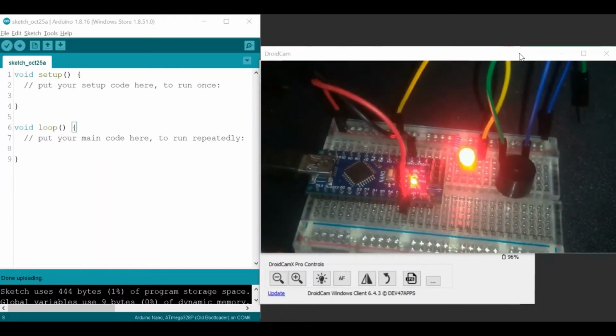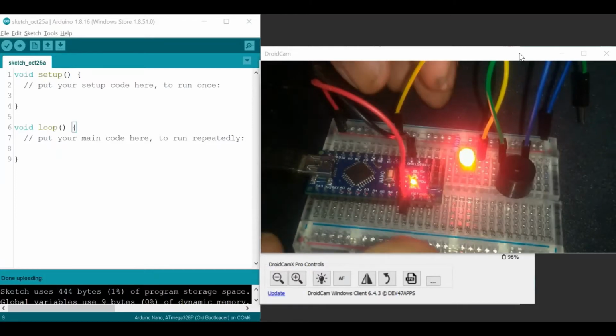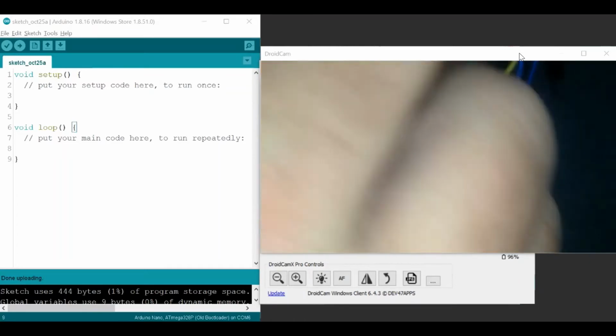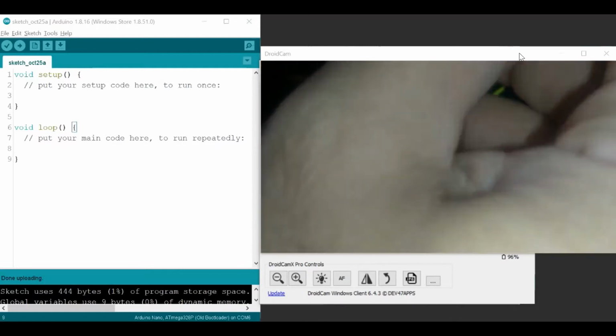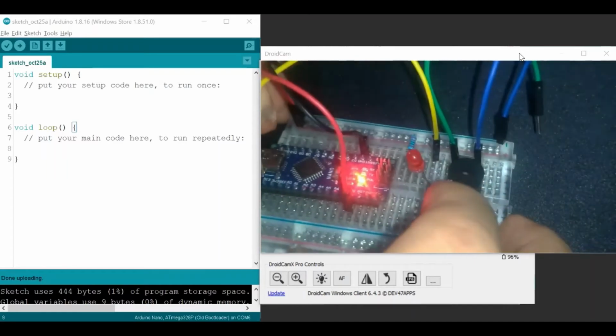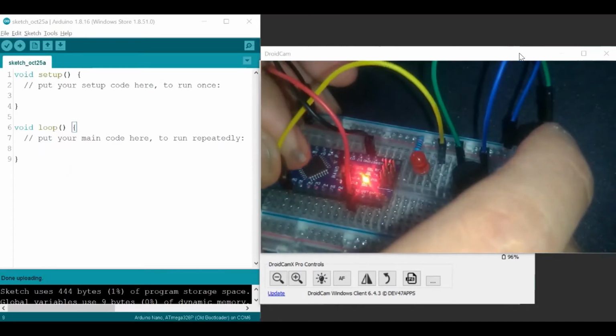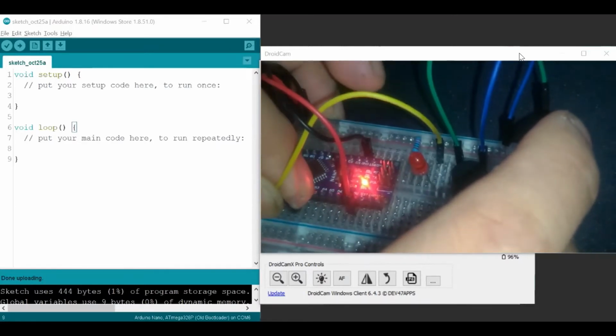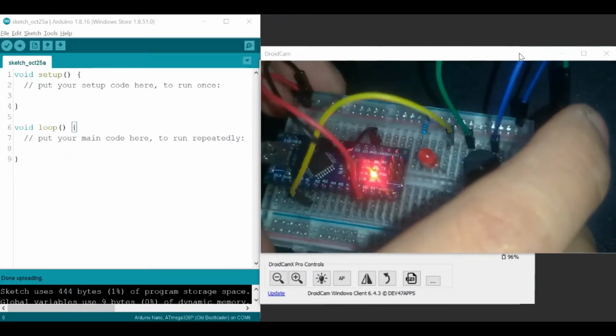Okay, so if I leave it connected there, it will stay that way. But what we're going to do later is we're going to make our code stored in the microcontroller control when the LED should light up. So I'm going to connect this to pin A1. Pin A1 is over there. So we're working with light that you see here, so I'm very careful.